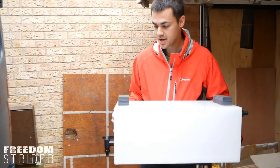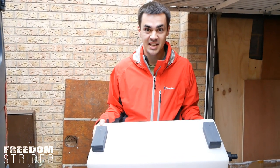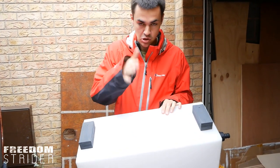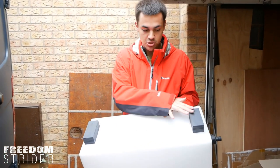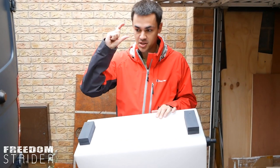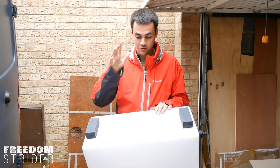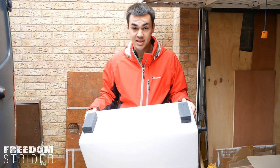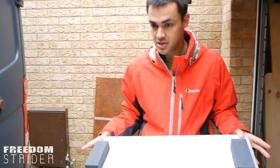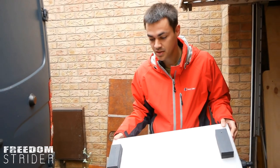Right. So, got the tank. Now, the buffers on top, I'm sure you're wondering what they're for, is basically to make the tank sit even when we push it up against the van, because there's a rib in the center that's lower than all the other ribs. So these two will just make the tank sit flush. And also, we need a bit more depth because our J-bolts run out of thread because they're slightly too long for the tank. So improvised, this should work. So now, we just bolt this up. Oh, we need to cut the steel plate. Oh, bother. And drill holes in it. Oh, bother.